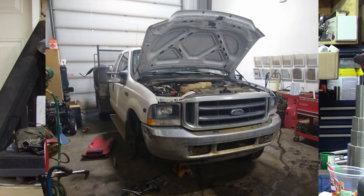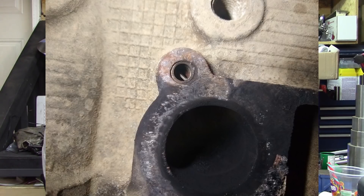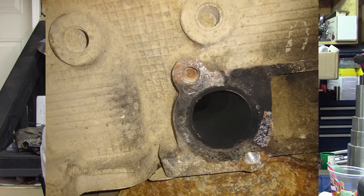As for the project, it's a 2004 F450 work truck and it's got the V10 engine in it. The right-hand exhaust manifold was popping away like crazy — the gasket was blown out. Sadly, it looks like some previous technician — quote unquote — tried to drill it out, failed, gave up, put a helicoil in for about four threads worth, and didn't even break the tang off the back. No wonder that stud disappeared; they probably didn't even tighten it down properly.